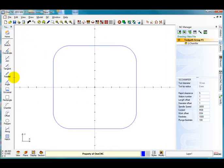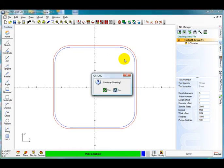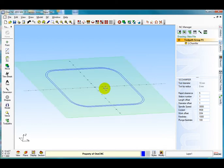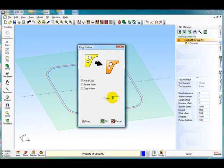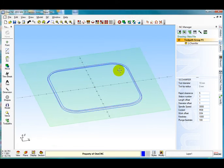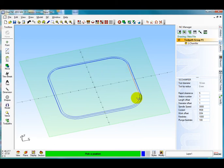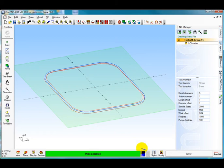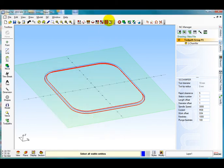If I just go into the toolbox and create myself a line. Line, offset — I am going to offset this by 2mm because that is the size of my chamfer. Pick it, direction, select the end. So I have offset that 2mm because that should be the top of my chamfer. I am also going to take this line, select the end, and I am going to move it — make one copy, select OK, increment, and minus 2. So you can see I have created that would be the size of the chamfer on the job. I am going to pick this contour, select the end, and pick the bottom contour, select the end. I am going to modify it — change the colour to red and also make the line style a little bit thicker so you can see it.